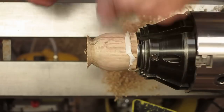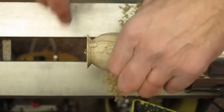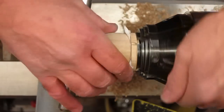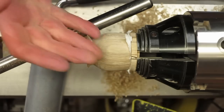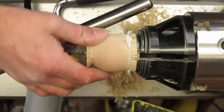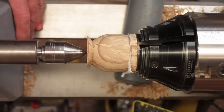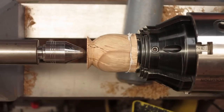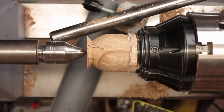There's no real need to dampen it on this one, but if it is a bit slack, all you have to do is dampen the paper towel — that will expand the wood and give you a nice fit. Now, always be aware when working on anything like a jam chuck like this to take very light cuts and, where possible, always put your pressure towards the headstock, otherwise it will flip out. For a little bit of extra security, just bring up your tailstock with a live centre and that will give you that extra stability — no real pressure needed, just to make it a bit more stable.